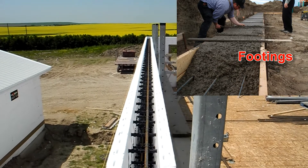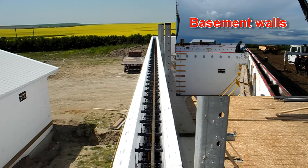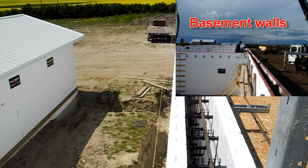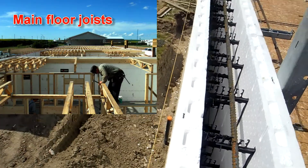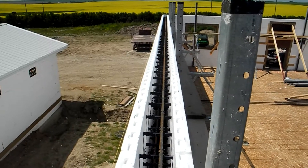I'm on a job here just doing an inspection before they place concrete. You can see here on the outside they've got their string line all set up. They've got it an inch and a half away so they can straighten the wall out with it. That's really good.